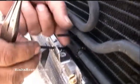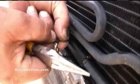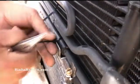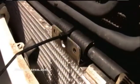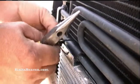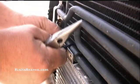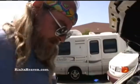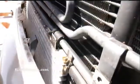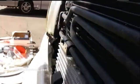I do it from that way because then when you cinch this up after it's in position, you have a nice little square fitting there. This one can be a little more difficult because it's usually just a tiny bit closer, but it didn't give me any trouble this time. Just snug it right up against that. A lot of folks cut these tie wraps off with dikes, but I don't like it because it leaves a sharp edge, so I use a razor knife to cut it off smooth. And the cooler is in.